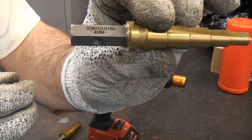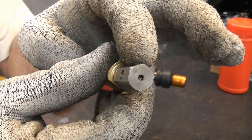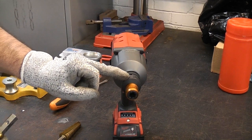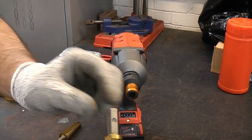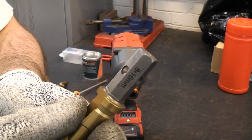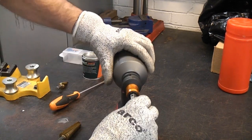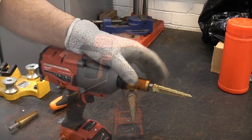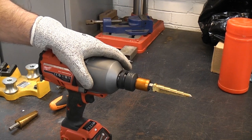These use the VersaDrive system which is an 11 millimeter hexagonal shank. So this is the three quarter inch VersaDrive adapter. On the front you'll see three arrows and on the actual hexagonal shank you'll see three indentations. You simply line that up, pull back on the collar and that is locked in position. These have massive time-saving advantages over traditional drill bits.